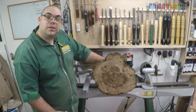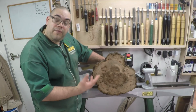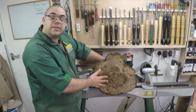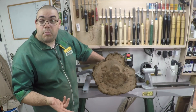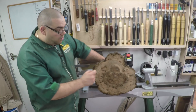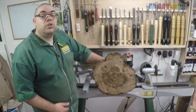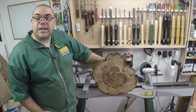That's all the turning done. I used a skew effectively like a negative rake scraper in order to make these two domes. I then used a round nose scraper in order to get this recess here. For the lines I used a diamond point carbide tool — it's got a really nice wide but flat small cutting point and that gives me these nice thick but not too deep lines. You could use a skew or many other tools, but I just prefer that tool because I find it a little bit easier.